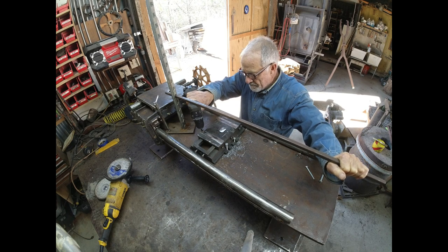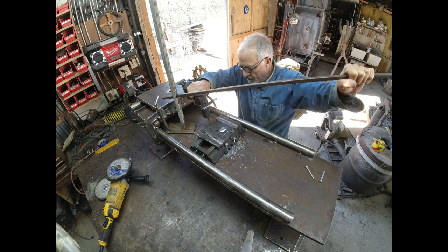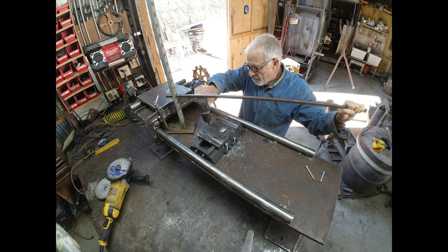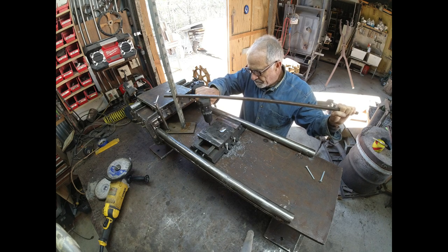This clip here is two 1/4-inch holes through the 3/4-inch thick top of this beam, and this is real time, and you can see how well drills do if you can just push on them hard enough. Now, if they're on the floor and you can get your body on top of them, you don't need this. But anything up high, it's really hard to push hard enough.